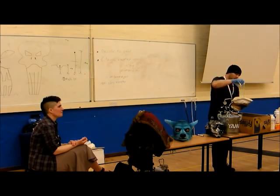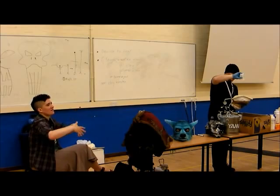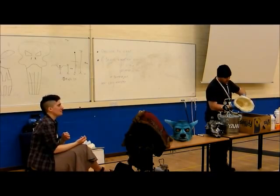When you pour it into the mould, pour a long, thin stream. The longer the stream, the better, because it pops all the bubbles. Now, what Zay is doing here is a rotocast. He's not filling the mould to the top with resin. He's pouring in a little bit and swirling it around so it gradually coats the walls. The reason he can do this is he's using a resin.